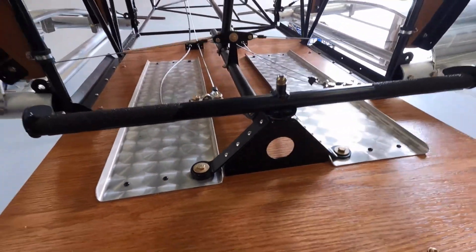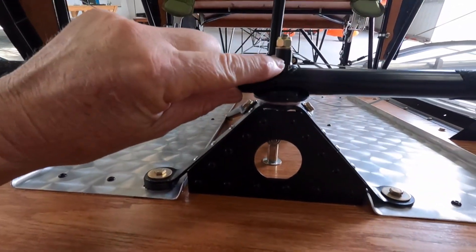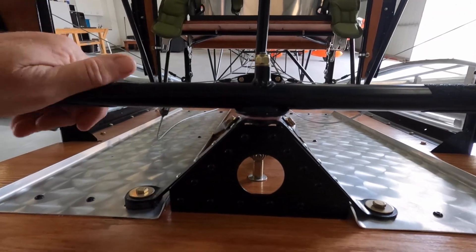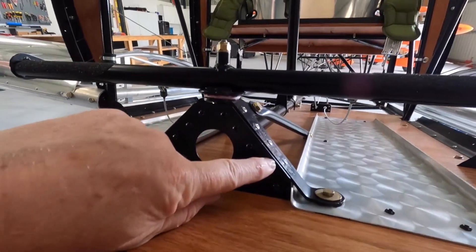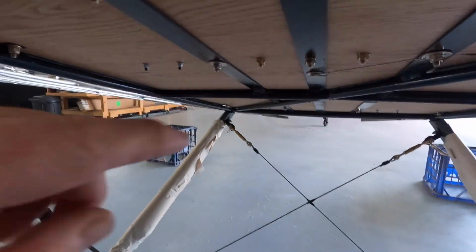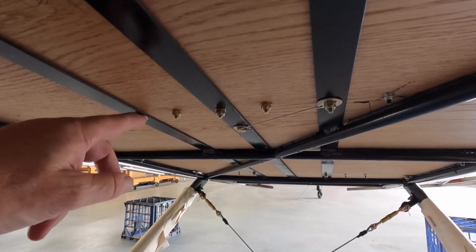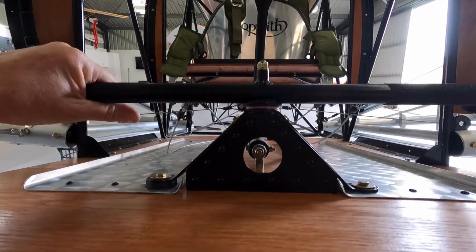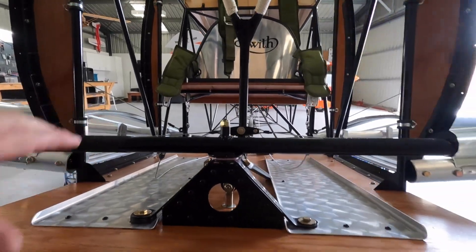There we go — I gusseted it in. The bushing could be better in there but for what it is, that stiffened it up quite a bit and I'll run with that. I can sleep well at night. I've got four 4mm — or 4.8 — rivets, the old Zenith rivets, coming through the floor, plus three more bolts through the strap. I was contemplating running an L-angle right the way across here but I think now you're not going to get much better than that. Let's move on.